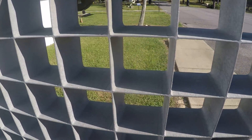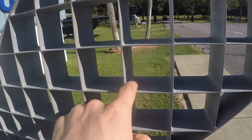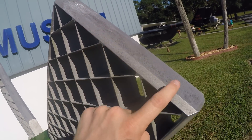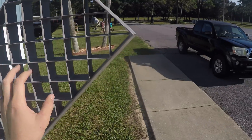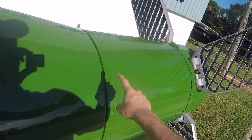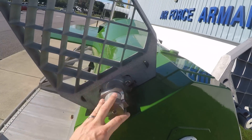Let's go in here and look at all this surface area. The ultimate goal of these things is to steer this device to the target, and you do that with an actuator here. If you were to add up the surface area inside this potato masher and create a wing of an equivalent size, that'd be a pretty big wing. But from the center of this grid fin to the most extreme edges, that's a pretty small moment arm. So it doesn't take a lot of torque to command a lot of control surface area. On a wing, if you had a huge wing out here, you would have to have a huge moment arm to control the whole distance, so the torque required would be a lot bigger. Therefore, you can have much more compact guidance actuators on devices that have grid fins.